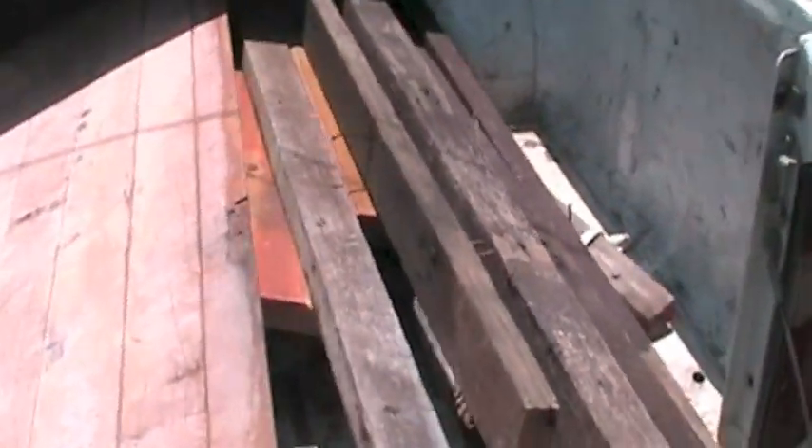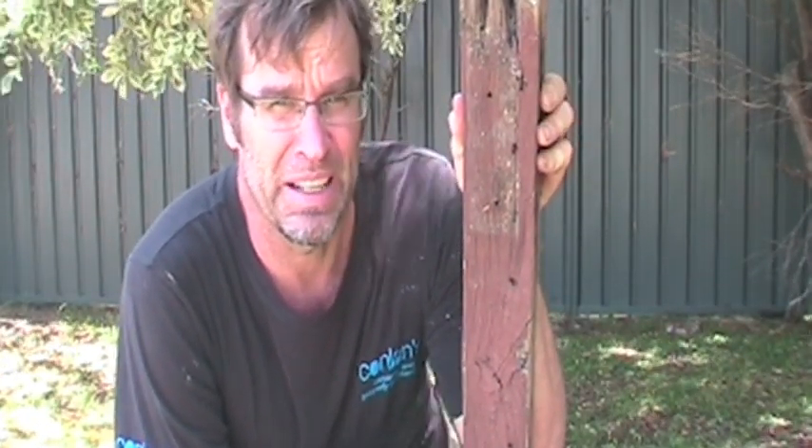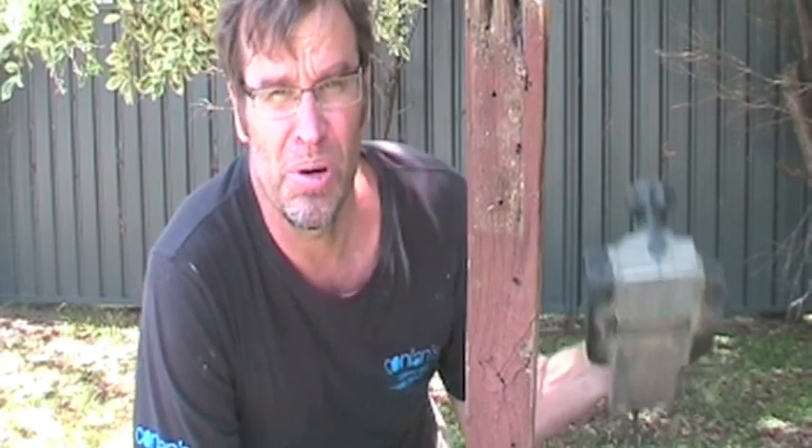Okay, let's get stuck into that. So I've de-nailed this timber, and the next thing we need to do is plane it down. I'm just using my old planer for this, because I'm bound to have forgotten to take out a few nails, so it's no doubt going to destroy the blades. Don't forget your earmuffs and your safety glasses - very important. When I'm planing this down, I don't want to plane too much off, because I want to retain some of that rustic charm.